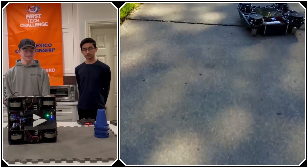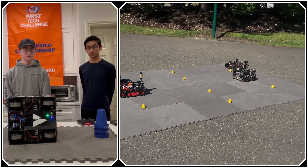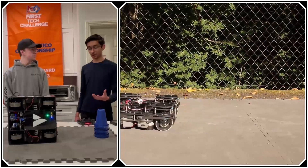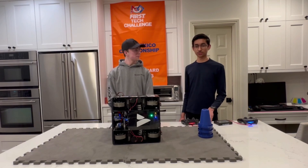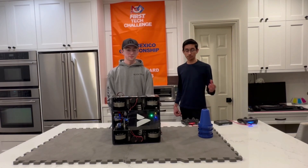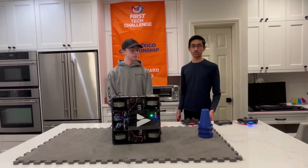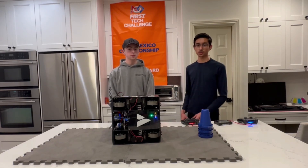I know you guys are using four motors and four servos. Have you had any power draw issues, or is that something you've had to consider when deciding the actuation components for all other subsystems? Our robot obviously has a lot of servos on it, and one thing that's really nice about running servos is they're extremely high efficiency. We're able to optimize all of our mechanisms to run at peak power output, meaning we're not wasting any power from our actuators. We pre-calculate beforehand how much current each subsystem is going to draw to ensure we stay under the 20-amp cap imposed by the fuse on the battery.